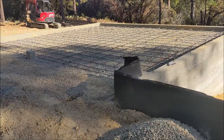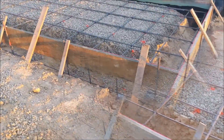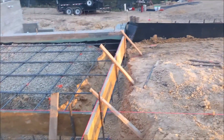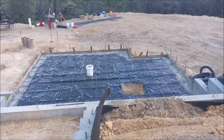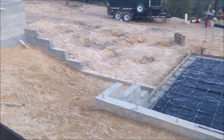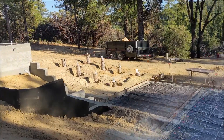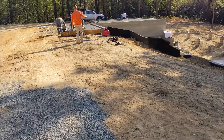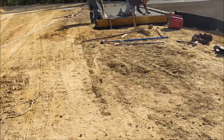This right here is the front porch where those piles of rocks are, and you can see all the metal that went in for the garage. This is a little bit later after the footing got dug for the front porch — corner post filled with rock and rebar put in there to make sure it doesn't crack. Down below, the basement's covered with visqueen or plastic, rebar's put in, and that hole in the plastic is a footing for a post that a beam's going to bear on — going from the stem wall all the way out over the basement down onto that post. Now they're digging in the posts for the deck — Sonotube filled with concrete, hardware on top, and those posts will go on those footings.